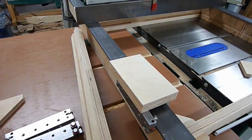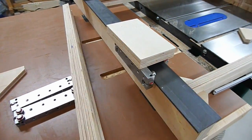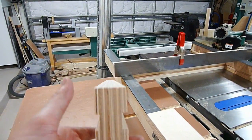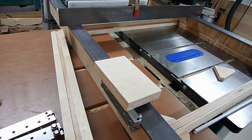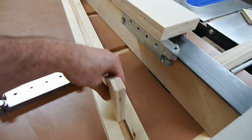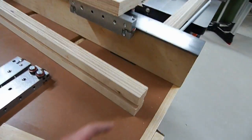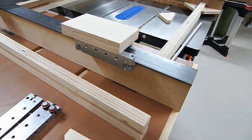This is just one of the pieces similar to this cross bracing right here — I just wanted to show you exactly what it is. We've got two pieces glued up and then right down the middle a dado, which fits an 18 millimeter piece of Baltic birch perfectly. That's what this thing locks into on both sides, so the cross bracing snaps right in there. I could have made it look nicer with stopped dados on both ends, but for sake of time I just ran it all the way across.